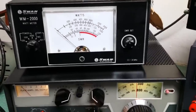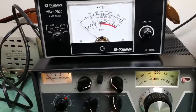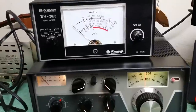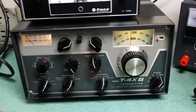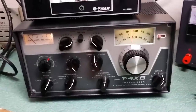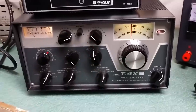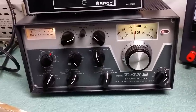I thought I had a little higher than 40 watts earlier, but on both 80 and 20 meters I got about 40 watts out, and only about 30 watts out on 40 meters. I haven't tried the other bands, so I don't know if it needs an alignment, if it has an issue, or if it's just the final tubes. But there it is — it is working. It's a beautiful physical example of the Drake T4XB transmitter.